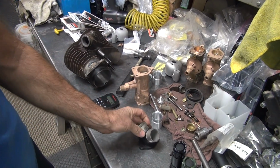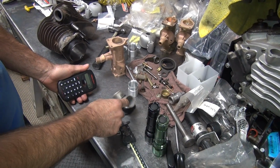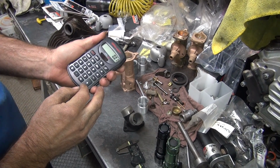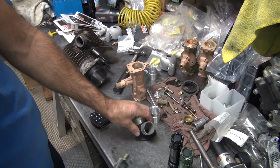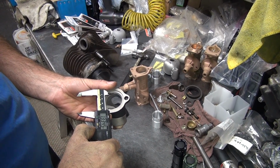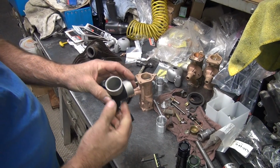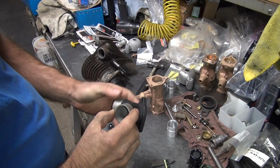But the best thing it's got going for it is that it's a quality piece. If you take that down to a 70 thou wall, that's 20 thou less per side, so you add 0.04 to this number. So now you're up to 1.320. So you can bore this thing out to 1.320, which is probably close to the outside of this. And that's almost all of that taper will come out. So I think as long as we have just a little bit of that taper left, we're safe when cutting this thing out. And then you come over from the other side, you can open this up to make this more even. And that'll make that a little better.